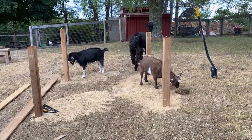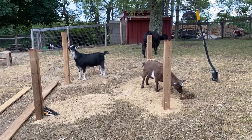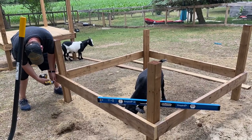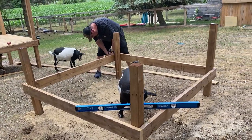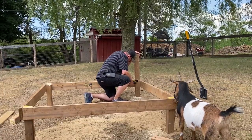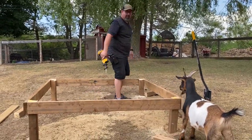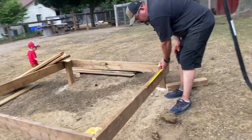Next enters our quality control crew making sure that everything is nice and stable and secure. We're screwing down the corners and then adding the braces in the middle and then more deck boards on top. Our ground is slightly uneven here but both platforms are sitting at the same height even though it doesn't look like that. Platform B is not going to get a roof so we're cutting off the extra posts. Our grandson Hunter arrives just in time to help Papa finish up Platform B.